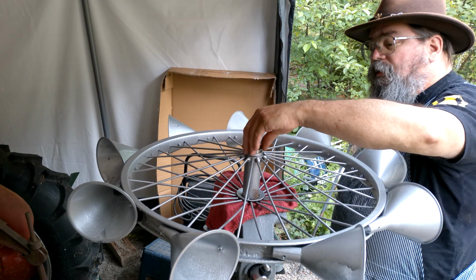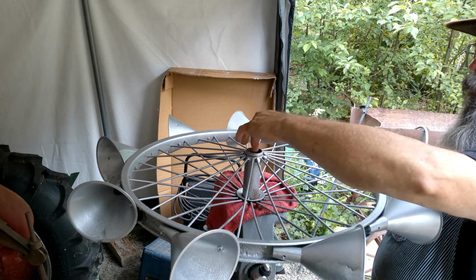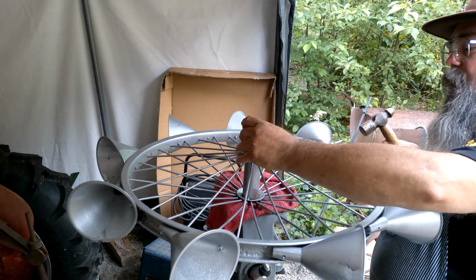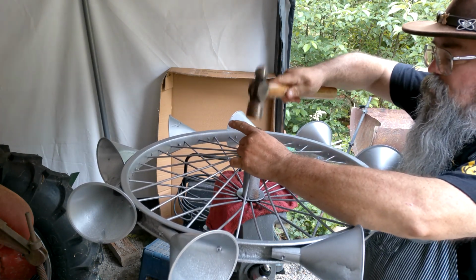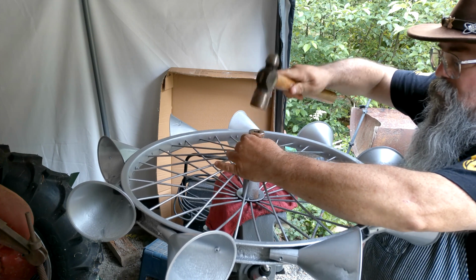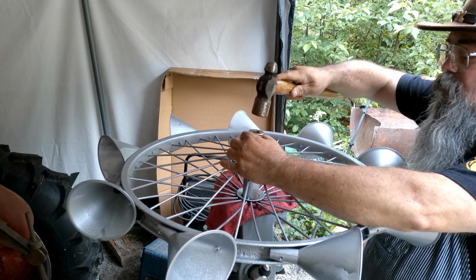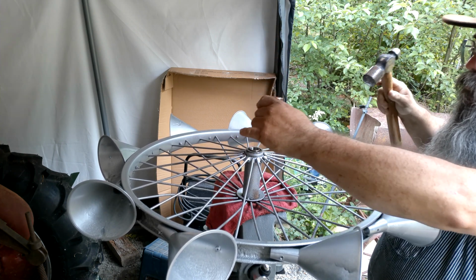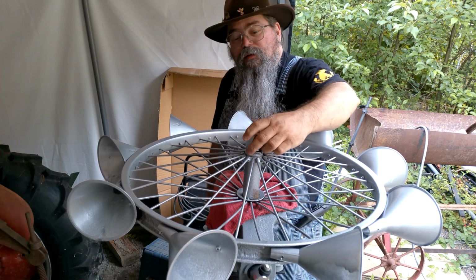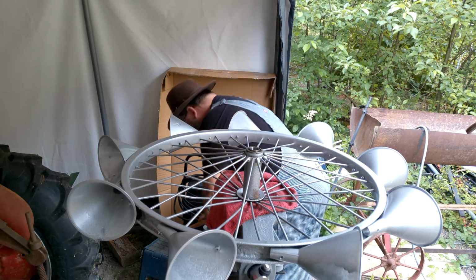Brand new bearings. I might have a little bit of a lip built up on it. I don't know. I hope not. The socket is just ensuring that I'm pressing on the outside of the bearing, not the guts of it. Not pressing on the important part, or banging on the important parts. There we go. That's one.